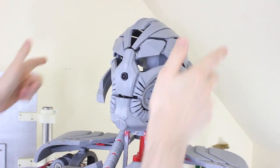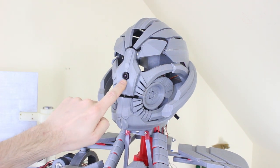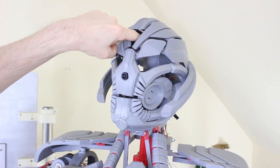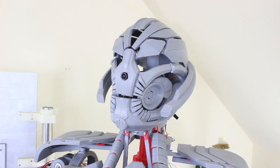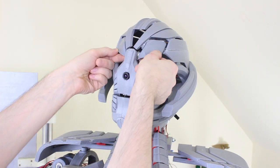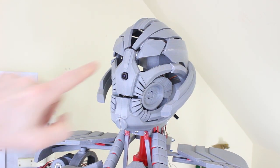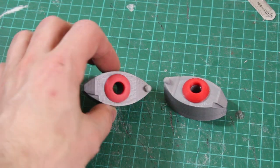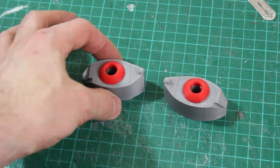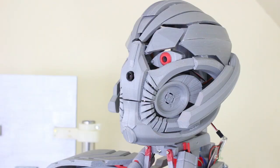Let's pop the top of the head on now. I think that looks pretty good. I've mounted the Pixy cam in the hole in his nose — I was going to put it in one eye or up in the forehead, but you'd have to go so far back because of the contour, so it's a bit unsightly but that'll do. Short of getting the animatronics working, the only thing it really needs now is some eye socket detail so it's not so empty-headed. These are Ultron's eyes — they've got holes in so the red light can shine through from inside the head. I've printed these parts in red ABS and stuck them on, and I think that looks about right.